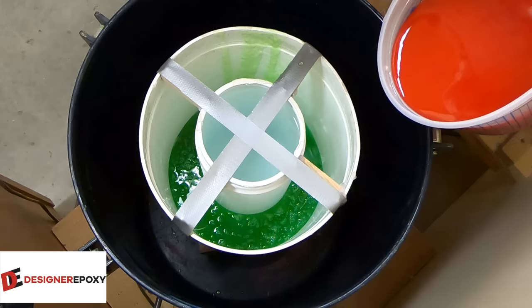Well, good morning. Just pulled this out of the pressure pot. Forgot that there was water inside of it and splashed it all inside the casting, but that's not going to matter because things are set. So anyway, I'm just going to dump this out, and I don't know if we're going to have thermal cracking in here or not, but I thought it'd be best to pull it out today and have a look at it. This is about 2.5 days after first mixing. So anyway, I'm hoping that there's not going to be any thermal cracking, but if there is, we can address it today, and that way finish this tomorrow. Or at least start on it.